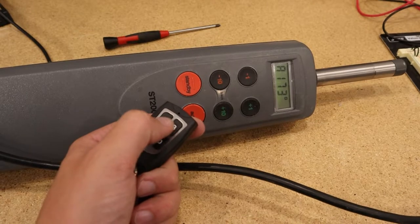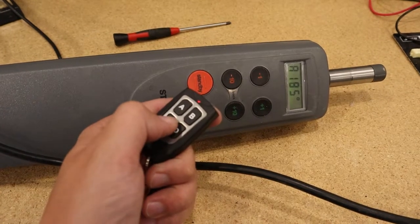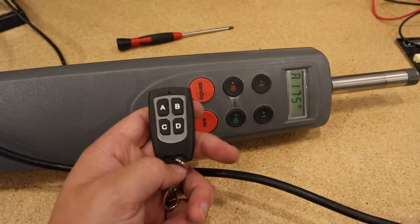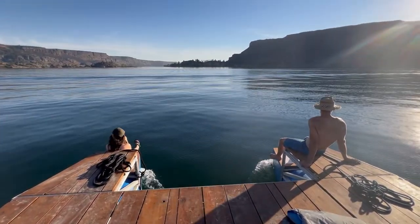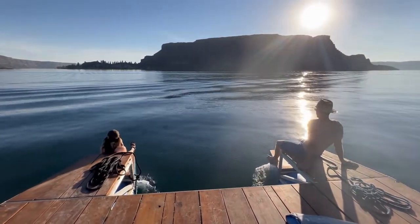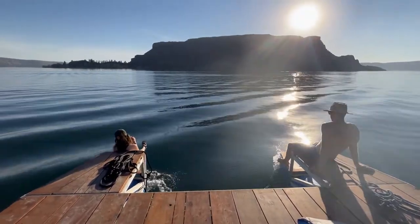In George's guide, buttons A and B do plus or minus 10 degrees and buttons C and D handle the auto and standby functions. I preferred a different setup: plus or minus 1 degree and plus or minus 10 degrees on the buttons, with auto and standby handled by walking back to the unit. That works better for me because plus or minus 10 degrees is quite a large turn — sometimes you just want to fine-tune it a couple of degrees left or right.